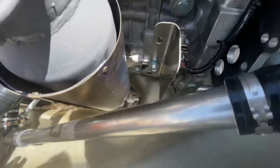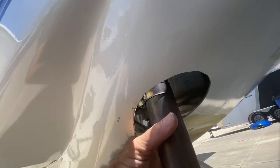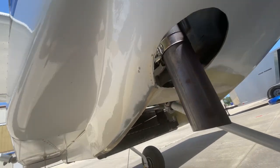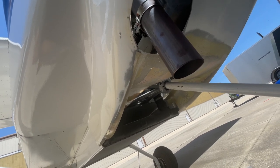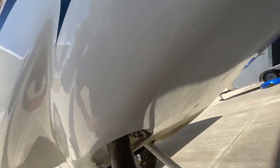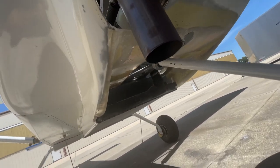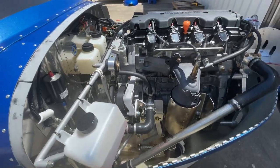We found that dumping the exhaust heat through that big opening was nice — it works perfectly. Now we have incredibly good cooling. You can start with just a smaller hole, and if you have to open it up, you just open it up. Most likely with this new ramp that we added, the cooling was just absolutely incredible — so much better than what we had before. We had all the air coming through the front before, and this was all closed up, but with this reverse ramp it really, really helped. Even on the hottest of days now, it barely goes over 200 degrees.